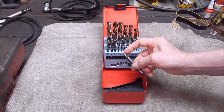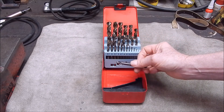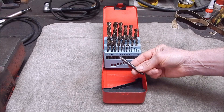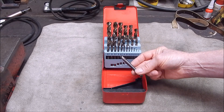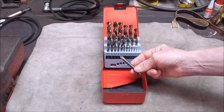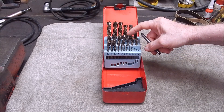These cobalt drills will drill much harder stuff than a standard high-speed steel spot drill. If you're going to work on hard stuff, some hard spot drills would be a good way to go. I thought it would be good to have hard cobalt spot drills. I had a look and they do exist - whereas these are a five percent cobalt set, Banggood has some eight percent cobalt spot drills which would be better again.